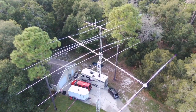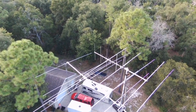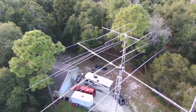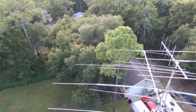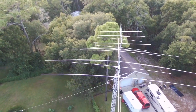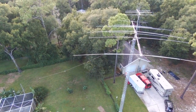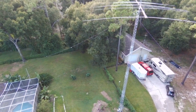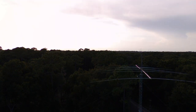The tower came down easily enough. I had to climb the tower — I had it nested — and physically turn the mast and orient the boom so that it was east to west so that the tilt plate would work. Since normally my antenna is pointed to the west and the tilt plate configuration required it to be to the east, I reversed the antenna so that it would be pointed west when the tilt plate was in position to tilt the tower over. As a result I had to disassemble all the top of the tower to make that happen.